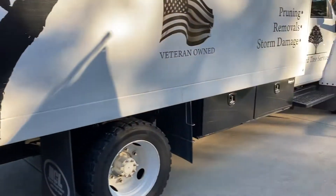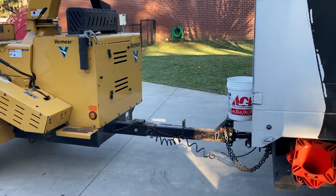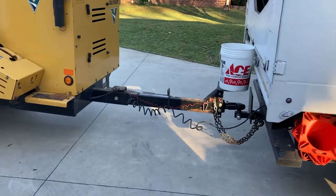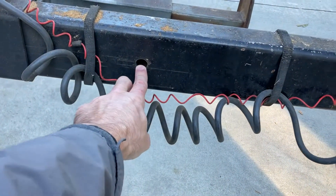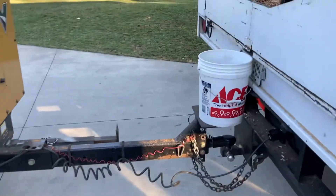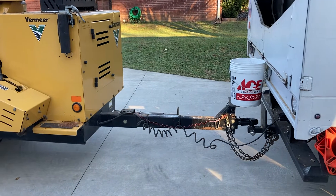We run a medium-sized Kodiak chip truck here, and backing this thing up — as short as it is on a long truck — can be difficult. So from the factory, this tongue has got multiple bolt holes in it. The factory setting comes at the shortest. We've extended ours back to the second position. That allows us to jackknife this truck almost at a 90-degree angle without damaging the hood.